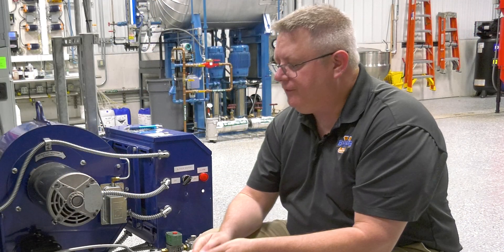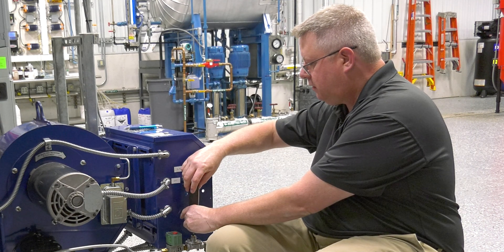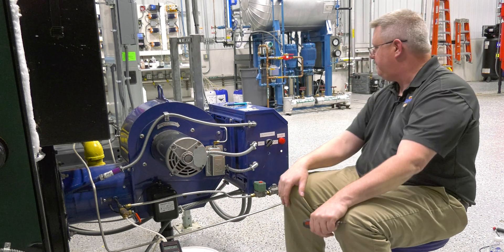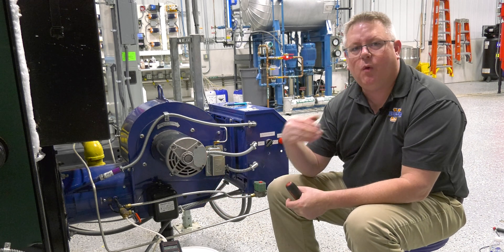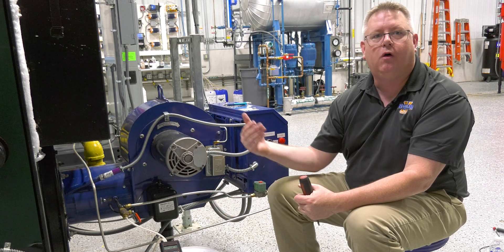I'm going to go ahead and drive the regulator through the range and see if my flame signal is equal throughout. When I get that gas pressure below an inch, I start seeing my flame signal drop in and drop out — that may mean that the pilot's not large enough to wrap around and get in front of the scanner, but it also may not be reliable for light-off. Now I've moved it to 4.6 inches, which has given me a lot more pilot gas, and I've got a good flame signal.